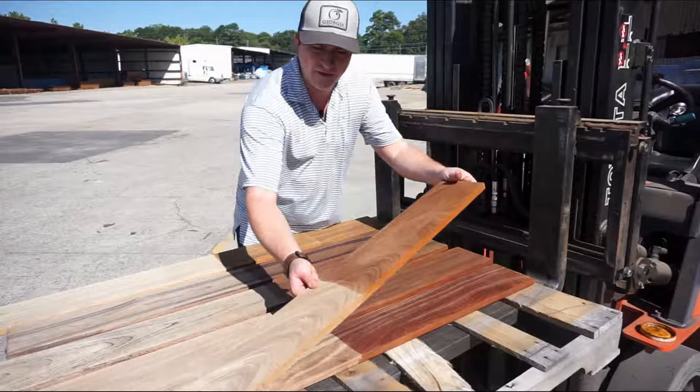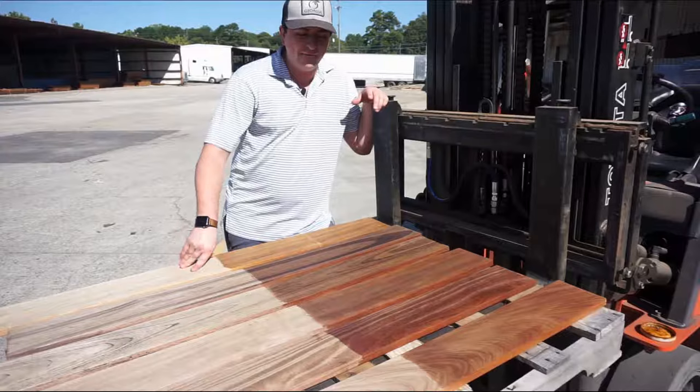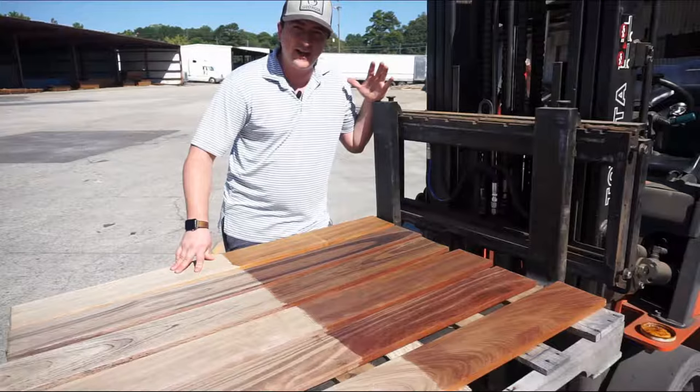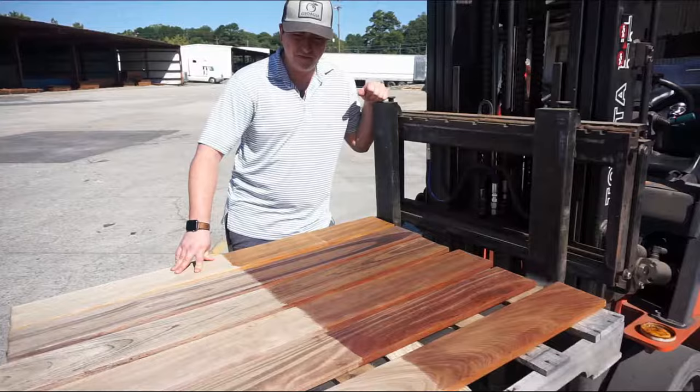Sunlight grays out boards. The UV oil helps to prevent that from happening, or certainly slows it down. Since these were new boards, they were ready after about three or four months for some more oil. Typically, decks are not getting that much sunlight, so the rule of thumb is really around six months — they're usually thirsty for some more oil. I'll throw these back on the roof and we will come examine them again in another 12 weeks to see how they look.